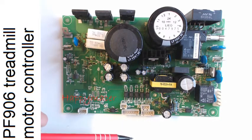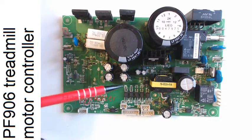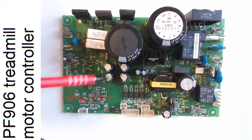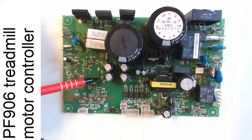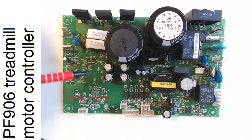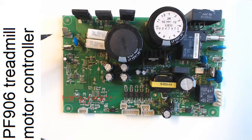That's accessible as a secondary 13–14 volt supply if you need it for something else. This output drives through smoothing capacitors and drives two linear regulators which provide minus five and plus five volts with a common ground. Note that this ground and that ground are not the same — they are not coupled, so that floats relative to this. This ground is connected to the motor positive terminal, so motor positive is actually at zero volts. Motor negative is at minus 300-odd volts relative to ground, and the five volt supply is then five volts above ground.